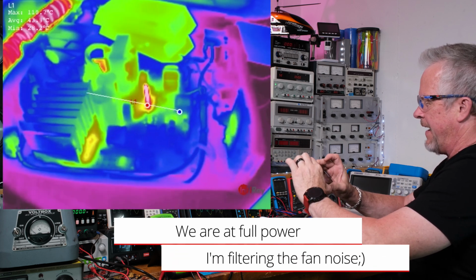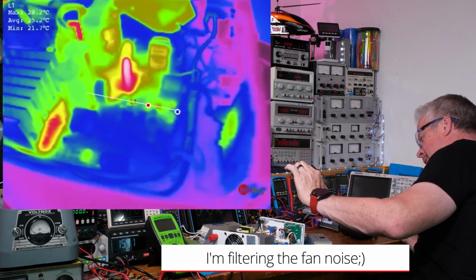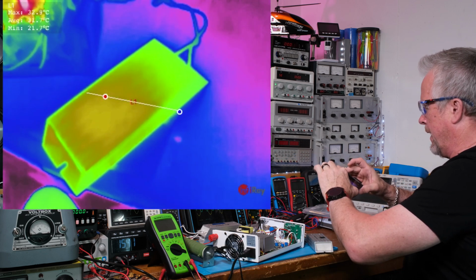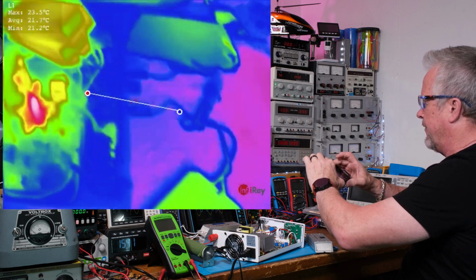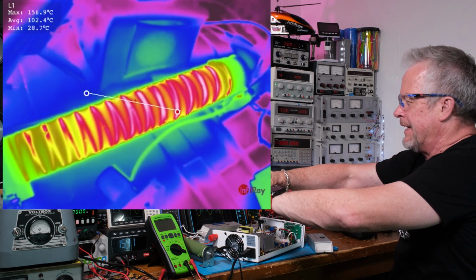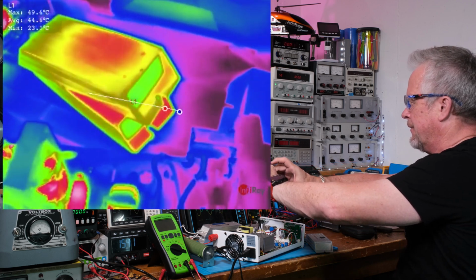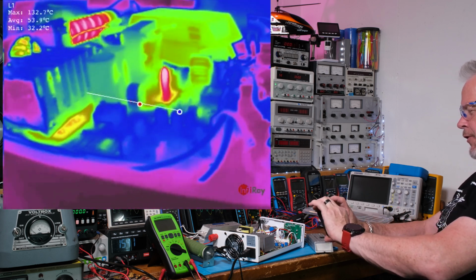Okay, guys, the fan is on. We got 570 watts, 31 volts. So the fan's on. I've got one 4 ohm load there, one 4 ohm load there. They're tied together to make 8 ohms. Over here I have two 8 ohms making 4 ohms, and then there's 4 ohms. And that 4 ohm resistor is getting much hotter than everything right now. So things are heating up, but it took just a couple minutes before the fan kicked on.